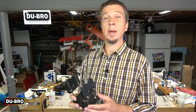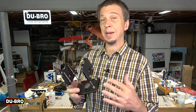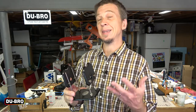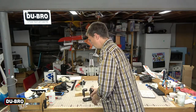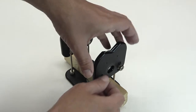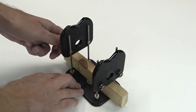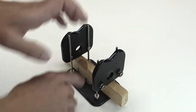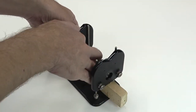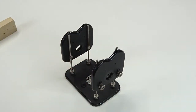The first thing I want to talk about is making sure that the tool is set up correctly. The TruSpin prop balancer has two side plates and the height of each plate is adjustable. For most of the balancing jobs you'll do, you'll want to make sure that both plates are set to the exact same height. Take a piece of scrap wood like a one-by-two and slide it under the plates and on top of the base of the balancer. Then loosen the nuts that hold the side plates in place and lower them down onto the wood. Once you have both plates in place, tighten the nuts and remove the wood — now both plates are at exactly the same height.